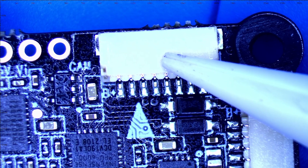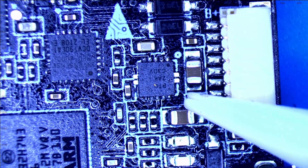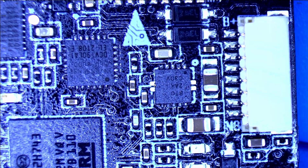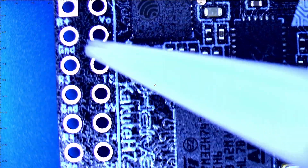This connector is your first four-in-one and this will be your second four-in-one if you choose to run that. Right here is your barometer - the BMP280 - very nice. And this is the MPU6000, which is your gyro. We're not really seeing ICMs much anymore - I'm not sure if it's due to the chip shortage or reliability - but that is the MPU6000.